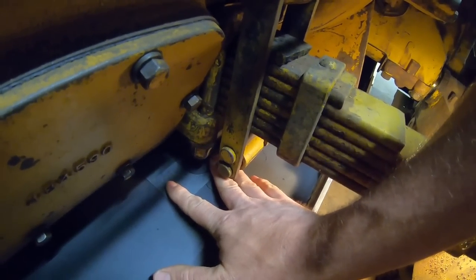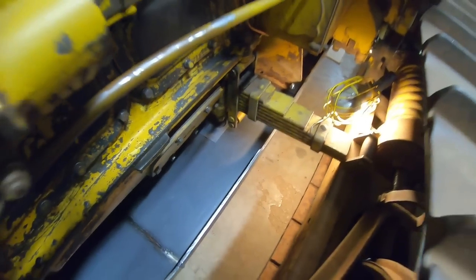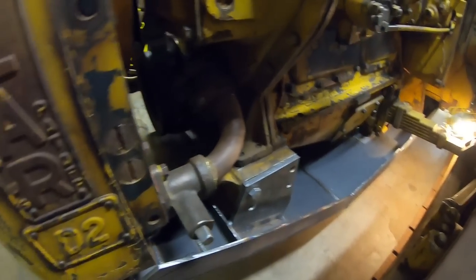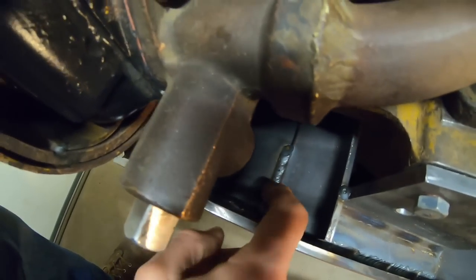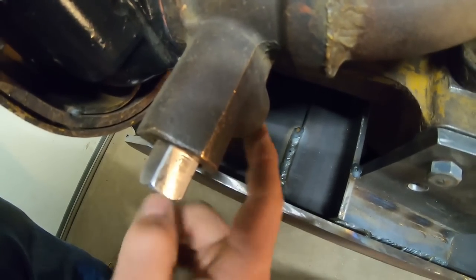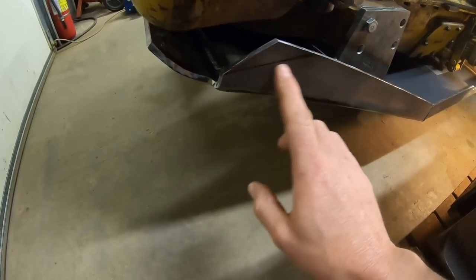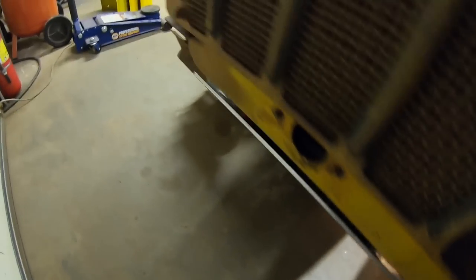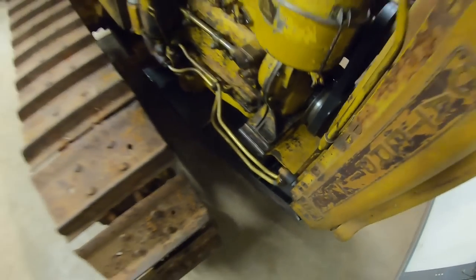And the reason why they put those 6 slotted holes in here is that once we get it in final position, it affords access to the U-bolt nuts for the mainspring and further in for that smaller equalizer spring. So you can service all of that from beneath the tractor without having to remove the pan. And we located, while we were down there, the 1.25-inch diameter coolant drain hole that is directly beneath the drain tap. I also got the front edges marked where I'm going to finish both of those top corners off. So I believe that's all the marking we had to do.